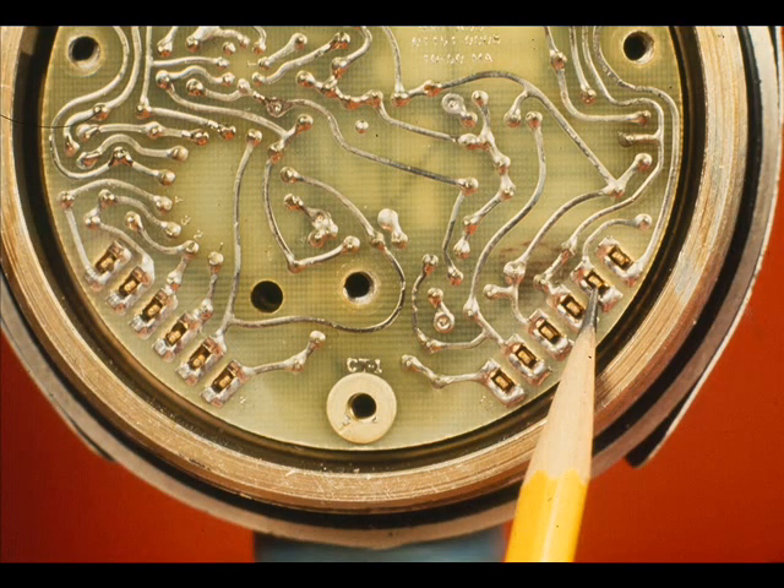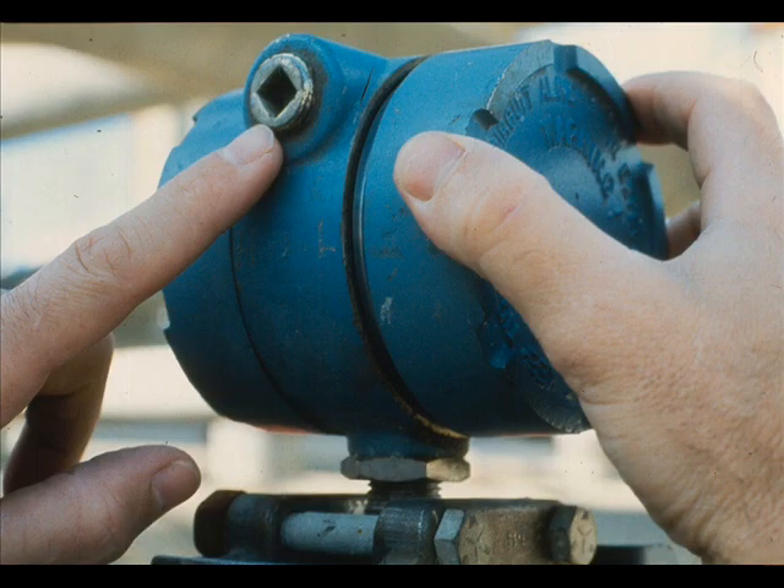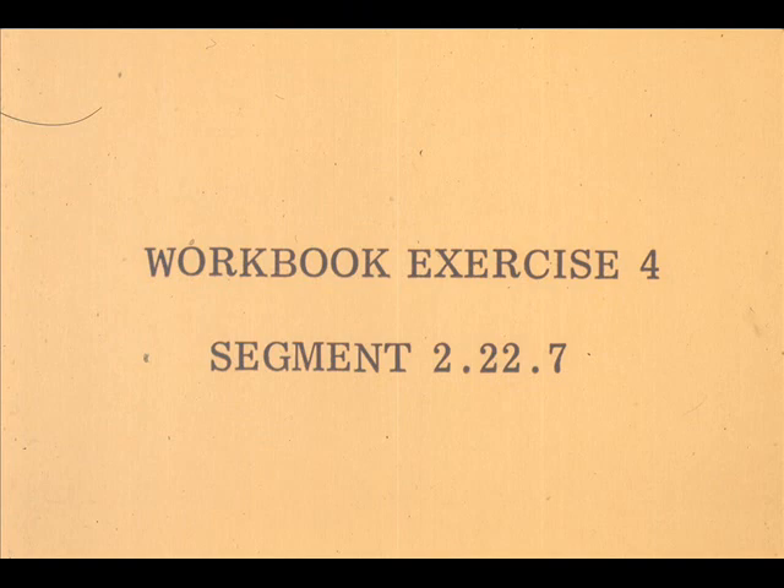For proper circuit operation, always be sure that pin number 8 is properly grounded to the case — it provides the case ground for the electronics section. A sealing compound should be applied to the upper surface of the lock nut before it is tightened, to prevent moisture from entering the circuit compartment. Be sure the compartment covers are screwed snug against the O-rings and that all conduit entries are properly sealed. If properly installed and tested, the transmitter should give accurate and dependable service.